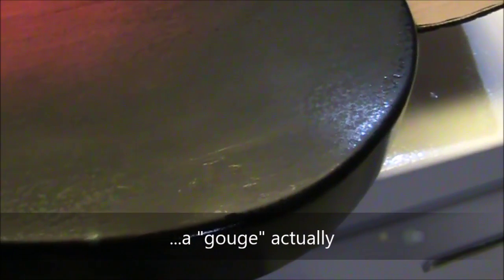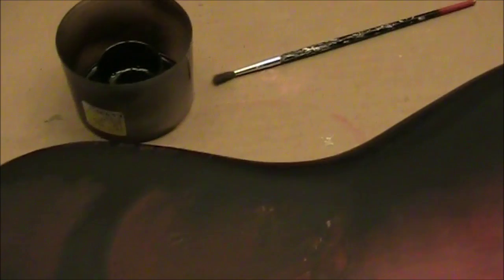So I'm going to experiment with doing a fill. And then there's a couple of dents in the finish. That's where there's a giant knot. And this, I'm not sure what that is. I think that's just a low spot from my hand planing. So there's a couple of dips in there, and if I just do a bit of paint touch-up in there, just a bit to fill it, I'll spray the entire back with urethane when I'm done.